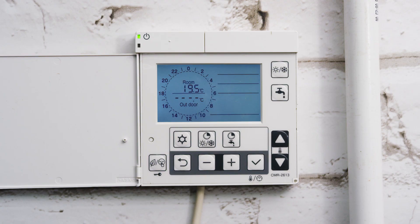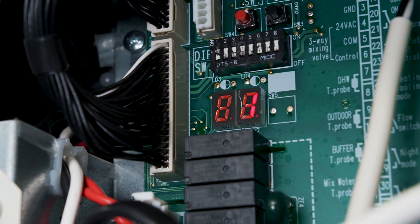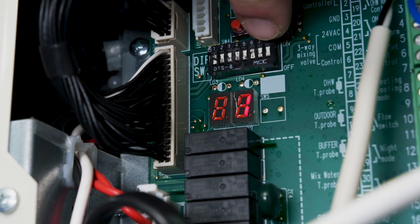There is also a fault code indicator. On the rare occasion there is a fault with the heat pump, the display would clearly highlight it, and the fault code would assist in identifying the cause. These fault codes can also be displayed on the two-digit display found on the terminal PCB, located behind the right-hand end of the unit.